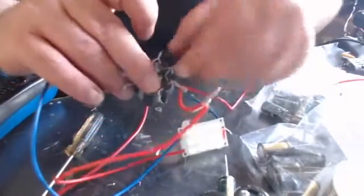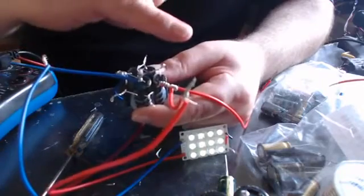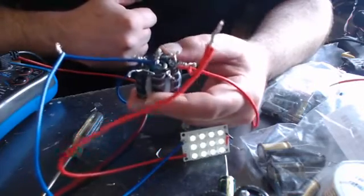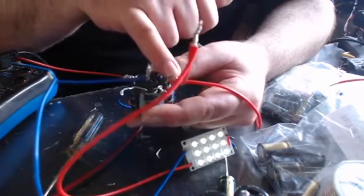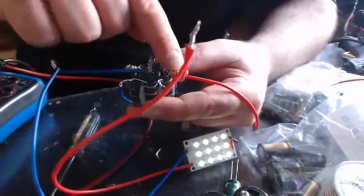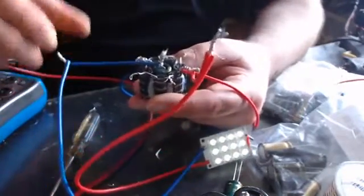Why? Well, when the center cap is going to be higher than 5 volts, it will not only charge one of these caps, but charge 2 of them, which in turn will raise the potential of this side, and it's plugged in parallel to this side. So this side will also rise in potential, right? Now we could continue this dance. To what extent? It's not needed, I think, in this case. It's still important to create balance on the other side, but it wouldn't charge it, because to recharge that one, it needs 8.1 volts of potential. It will only charge it if this one has more than 8.1, and that's not very logical in this system because we need a difference in potential. It's hard to explain. I won't go into that part.